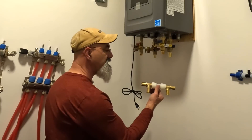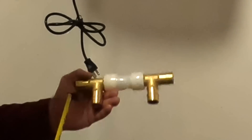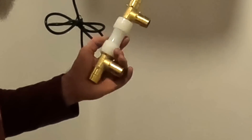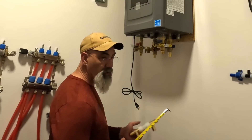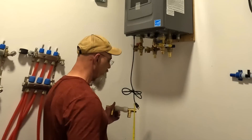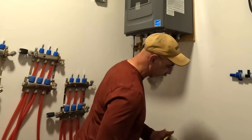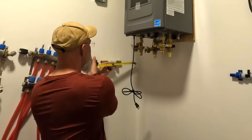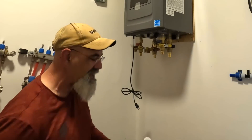These are my two close tees from my primary loop. I'm supposed to have four inches between these because these are one inch — four times the diameter between them. There's no way to get that close because I'm using PEX. I am about four and three-quarter inches. I'm supposed to have a minimum of six lengths of the diameter coming off each side — I'm going to exceed that because I'm going to be tying things into it, so I'll make sure I'm at least six before I turn. I've done all the planning — I've drawn this out and thought about this six ways to Sunday.